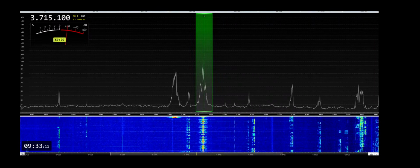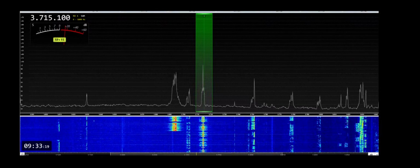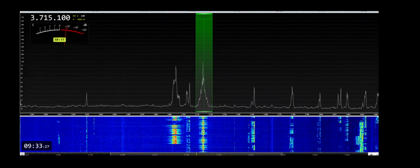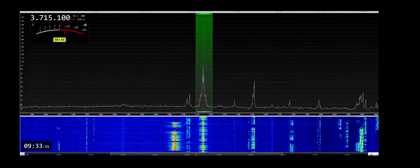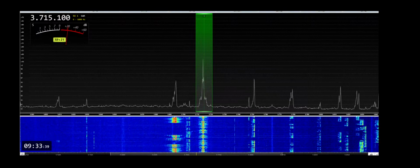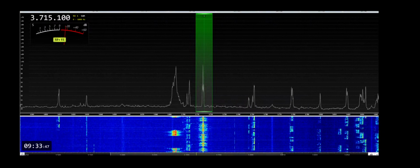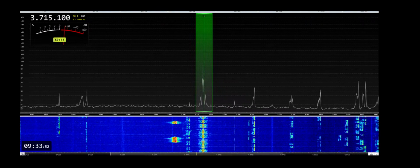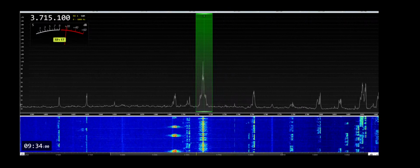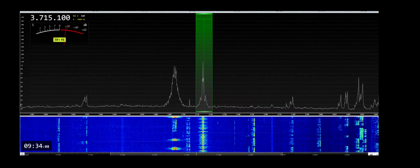And Gary, on drive level control, I've got a couple of the Alinco SRT9 transceivers, and they do not have a variable power output control. MFJ makes a little black box that you plug into the ALC if your transceiver has an ALC input, and it's a variable input to the ALC, so that it varies the output of the transceiver so that you can drive an amplifier. That's a neat little trick, and they're pretty inexpensive and pretty simple. If anybody needs more detail, I can give them that.